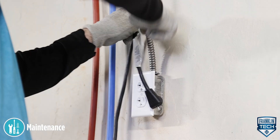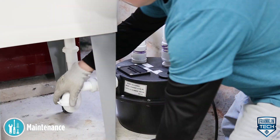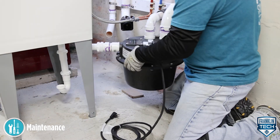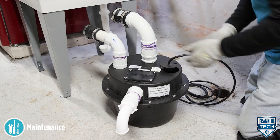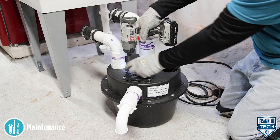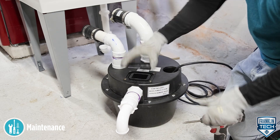To clean the entire system, first remove the basin from the system and plumbing. Remove the cord grommet. From the cover, remove the four screen cover plate screws, plastic cover plate, seal rings, and screen.